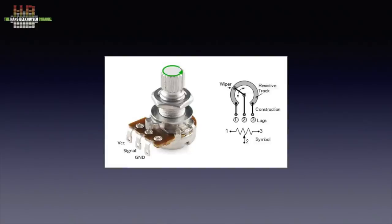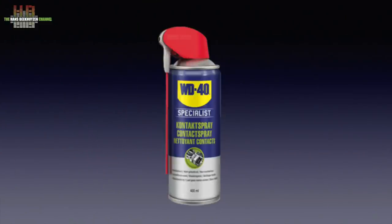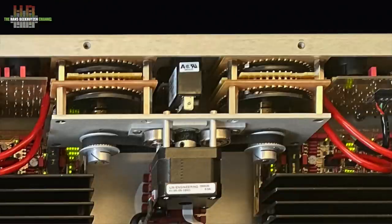A digital volume control uses a rotary encoder — when the volume knob is turned, it sends short pulses to the chip that does the volume control. An analogue volume control is normally a track of carbon with a copper sliding contact; depending on where the contact sits on the carbon track, there is a certain resistance in series with the audio signal. The higher the resistance, the lower the volume. There is often a small difference between left and right channels, and the track wears over time. Dust can be a problem too — we all know what contact spray can do: fix it for a week. High-end equipment may use potentiometers with a conductive plastic track, which are more durable. Some amps, like my Air Acoustic AX5, use a motor-driven multi-position rotary switch with precision resistors — costly but very fine. But usually today, digital volume control is the better option.